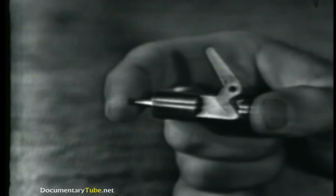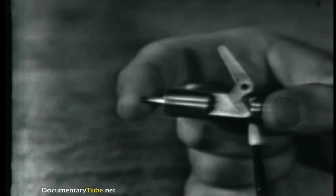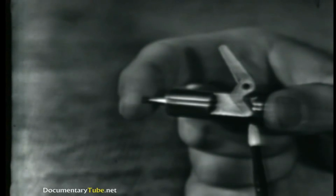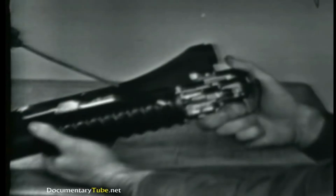Firing is initiated by squeezing the trigger. An upward pull on the trigger causes it to rotate slightly on the trigger mounting pin in the receiver. As the trigger rotates on the mounting pin, the firing spring is further compressed. This will add force to the firing spring, which was partially compressed during cocking. The trigger sear on the front of the trigger moves downward while the rear of the trigger is pulled upward. The trigger sear will move away from the shoulder of the firing pin, allowing the firing pin to be driven forward by the compressed firing spring. The firing pin will extend through the breech of the receiver to strike and detonate the cartridge primer, thus firing the grenade launcher.